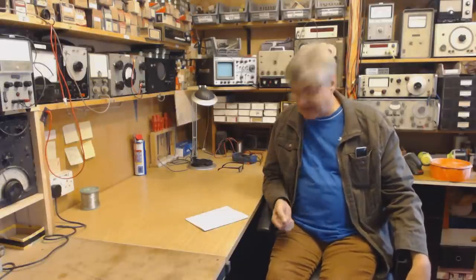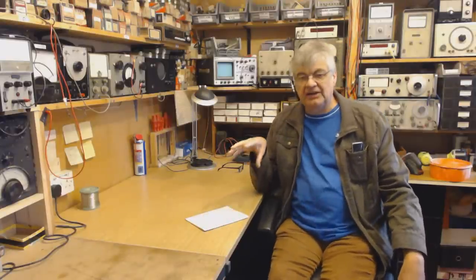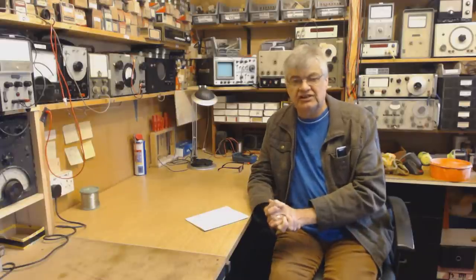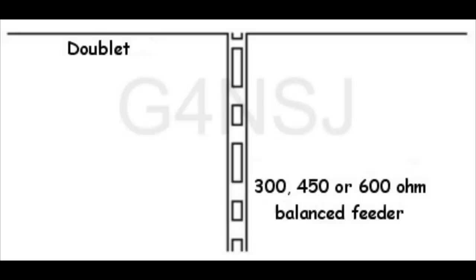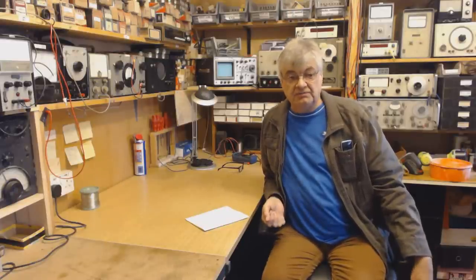It's not heavy and you don't have to worry about it flapping about too much. Feed the middle of your dipole with that. Bring that into the shack into a balanced ATU — a properly balanced ATU. Was it MFJ or whatever? I use the KW107, which is an old 1960s aerial tuning unit — it's lovely. Have a look at the diagram here. This is your dipole, fed with the 300 ohm like that, very straightforward. Bring that into the shack into the balanced input on the ATU. Obviously adjust your ATU for minimum SWR — you should get 1 to 1.